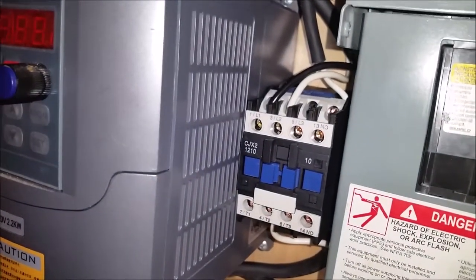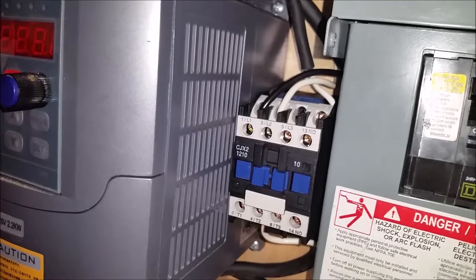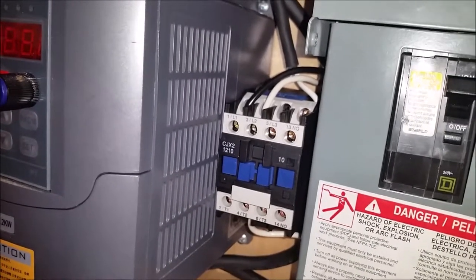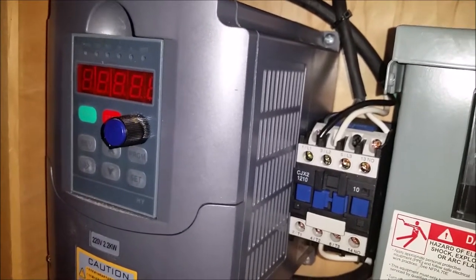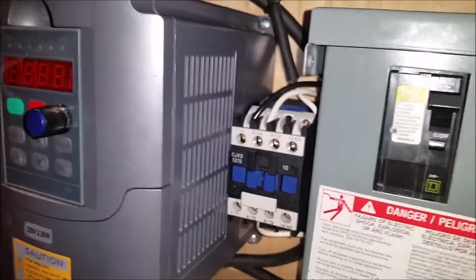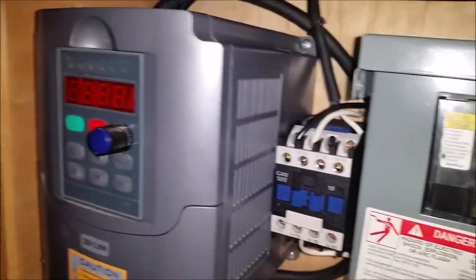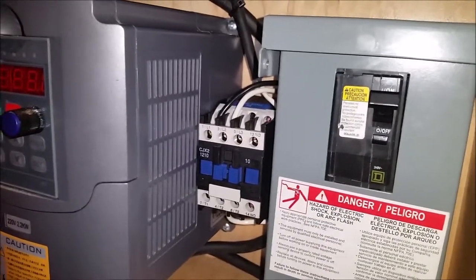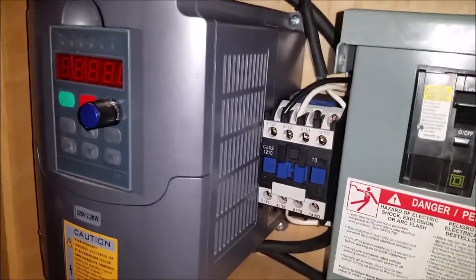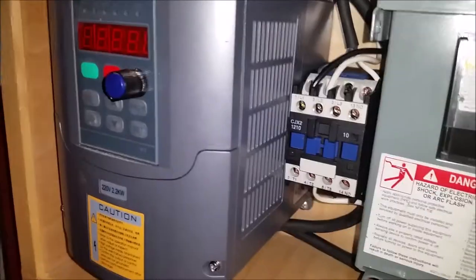I chose to use only two lines — the 240 — you can actually connect this to the spindle motor itself, since this is a three-phase contactor. I chose not to do that because I want the VFD to shut off and reset itself. I don't want it to power back on if, say, a breaker trips and I go out and reset it and forget to turn the switches off — the spindle would come back on. So the only way to restart it now is through Mach 3 after the computer is rebooted. It's more of a safety thing. I wanted to shut the power off totally to the VFD.